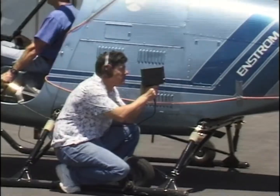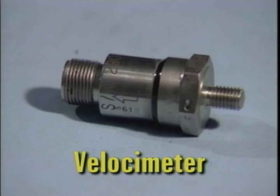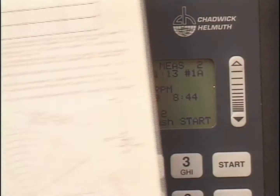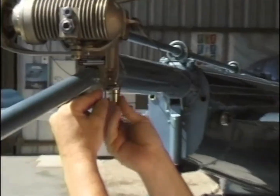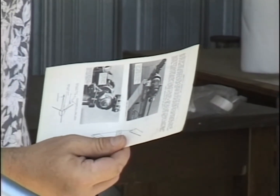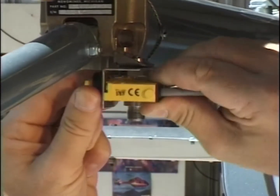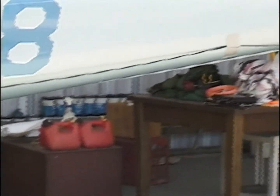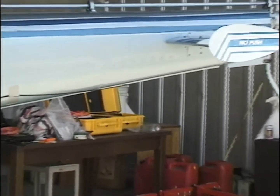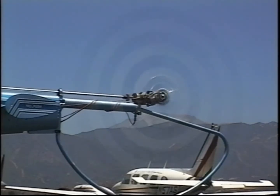A plus image indicates a perfect track. Adjust the tail rotor pitch change rods to achieve this picture. Tail rotors are balanced using the photocell, velocimeter, aircraft tail rotor balance chart, and the rotor protractor. Install the velocimeter as shown in the tail rotor balance chart for that specific aircraft. Install the photocell in any convenient location where the beam will strike the tail rotor. Attach and run the cables into the cabin, taking care to ensure the cables cannot foul in the rotor or any drive components.